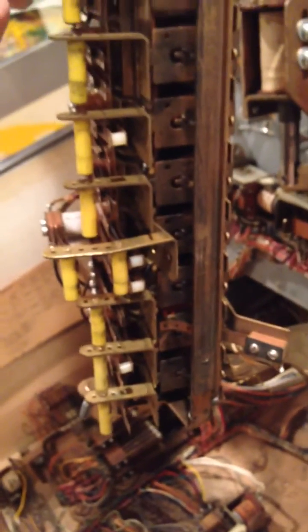Unfortunately I didn't know this problem existed, because when you swing the whole reset unit out and look at all the switches and all the relays, you can see that the relay arm doesn't hit that stopper anymore — this arm here — and so it sat further away. So I adjusted all the switches thinking I had them right, but as soon as I put it back in the frame and locked it in place, that relay arm jumps out a little bit and things don't work like you think they should.